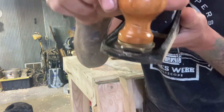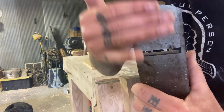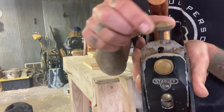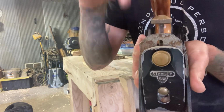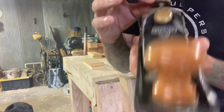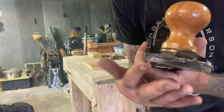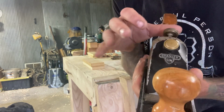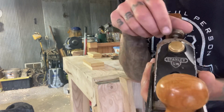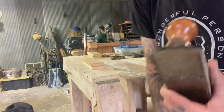This is for your throat, and we'll call that throat, is this plate here on this, and it goes up and down like such. This adjusts the depth of this. It pushes it in or pulls it out. And also you can move this from side to side, and that'll adjust the angle of this as well. So if you're cutting too deep here, pull it up. If you're cutting too deep, period, up. If it's getting jammed a lot, open your throat some.